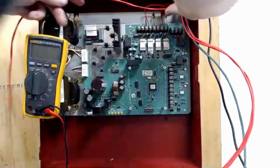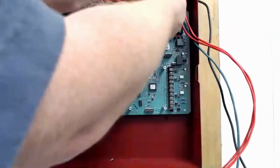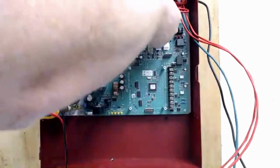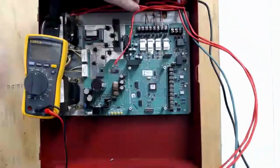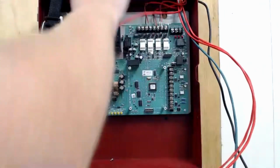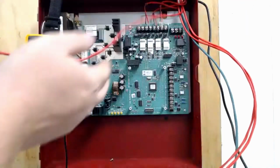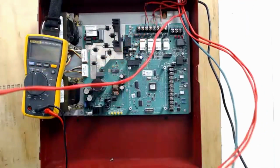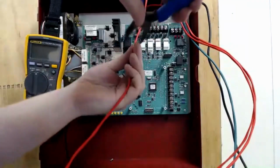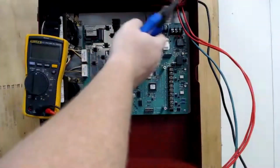And so for a service loop, someone might make the loop and then flatten it out like this up here and curve down to grab the terminals like that. So you'll see a bundle of wires across the top. And again, that's not wrong. You still have a service loop, but you have this bundle of wires. And if you ever have to come back and do service work and chase the circuit on this panel, you have to deal with that bundle of wires. So I'm going to continue doing it this way because it makes identifying the wires just easier. And landing the NAC circuits like this is fairly straightforward.